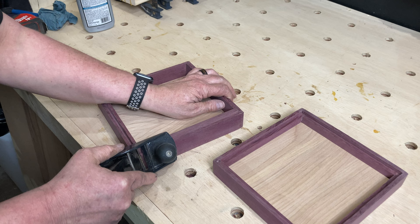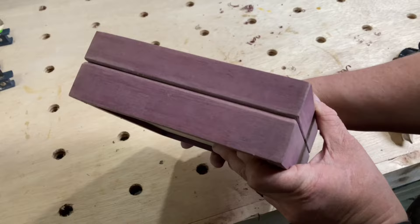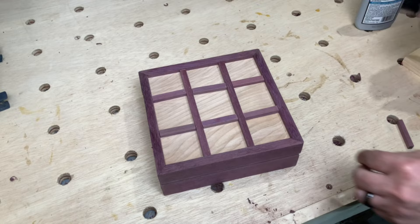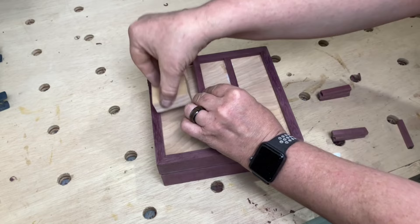After a little sanding, I used a hand plane to put a chamfer on the opening of the box to add a little bit more dimension. The top of the box is inset a quarter inch, so I cut some strips of wood a quarter inch thick to make the tic-tac-toe pattern on the top of the box. I wanted the square areas to be two-inch square, so I cut a scrap piece of wood to use as a spacer when I was gluing the pieces in.